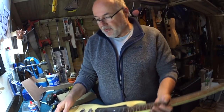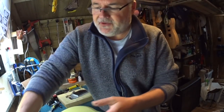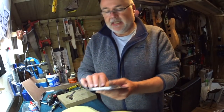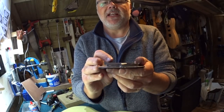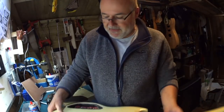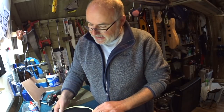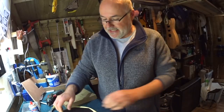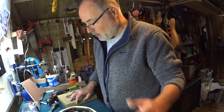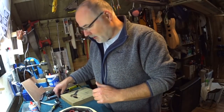counterbalance this body. So off camera I was working with a little bit of lead I pinched off the church roof, joke earlier. And I made a little template, and it made me a little block of sheets of lead that will fit into this compartment on the back, and there was a limit to how many pieces of lead I could fit, obviously, because it has to sit just above the pot tops, and lo and behold, it does. And actually, on weighing this, we've got ourselves 0.5 kilo of weight, which is a nice little added weight. Funnily enough, that's only just enough to balance it, but it's going to be considerably better than it was.